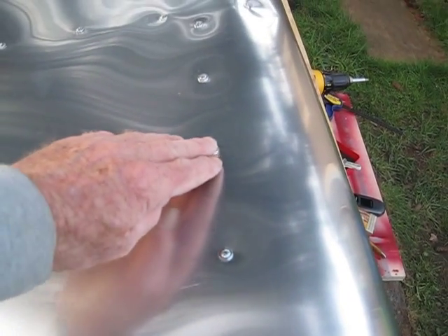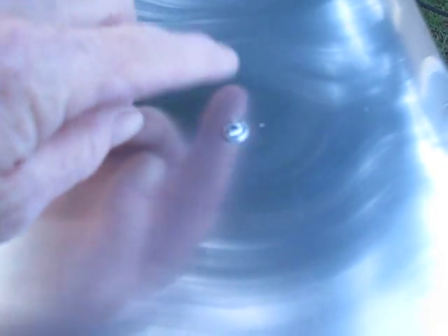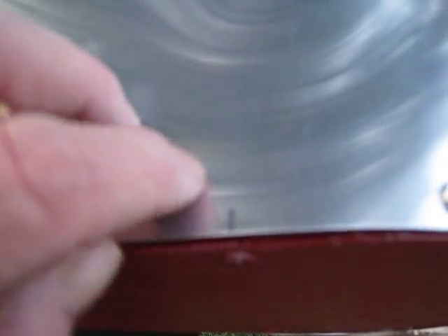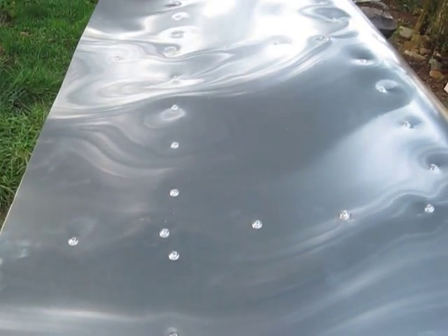Then I had to go all the way across those ridge caps that run the full length, straight down both sides. There's a little tick mark that marks the strut running straight down, and I marked it on this side and down at the other side. I ran my tape measure straight down the edge, clamped it on both sides, then just used the tape measure to mark every four inches the same way — that worked a lot better than guessing and gave a halfway decent straight line.